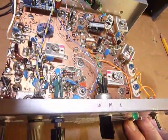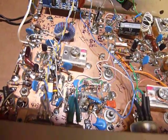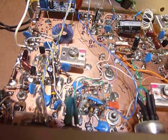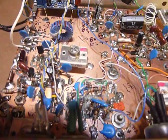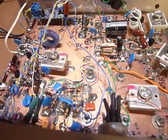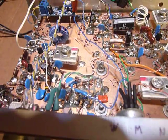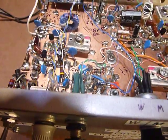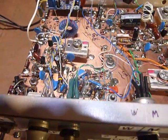And it looks like I used a lot of solder, but when you do this kind of construction and you're using a nice hot soldering iron, you will find the solder just flows out on there really nice and makes larger soldered connections to the board than what I would normally want, because there is no masking to hold that solder in a small place. So it just flows out. So there's a lot of silvery looking things in there from all that flow of solder on the board.